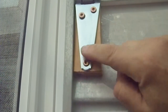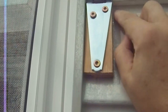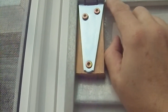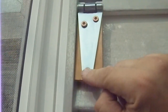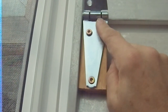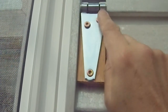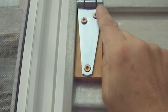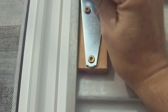I got three screws in. This is a spacer block to lift it away from the building a little bit, compensating for the thickness of the aluminum siding. This one is into something solid. That one is into something not so solid. And that one is into nothing. So I need to figure out what's in there, because I need these to be in further — this is going to be holding a fair amount of weight when I'm done.